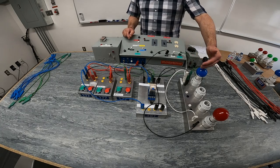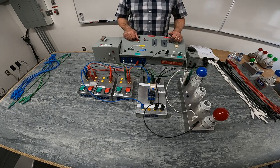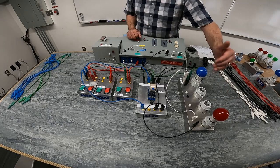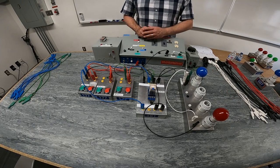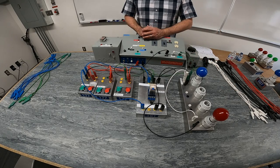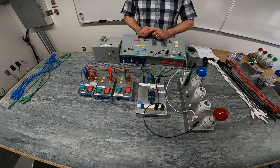Now you can consider these two lights where we can only have one of the two illuminated at any time — this could be a form of interlock so we only have one device operating at a time. For example, if we had a forward motor and a reverse motor, we only want to have one activate at a time. This could represent the exact same type of connection.